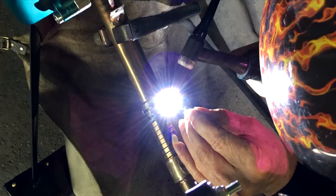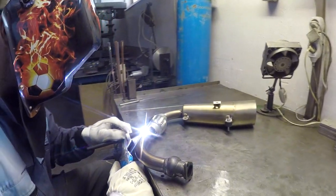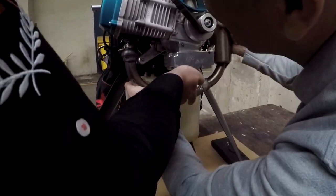Roland from EOS managed to fix the carburation issue. We also had a rough idle at the beginning, so Roland made a few modifications — he decreased the compression ratio, probably sacrificing maybe half a horsepower, and installed a flexible hose into the pipe which helped reduce idle vibration. However, that flexible hose broke twice already in flight, so we had to change it to a higher-quality one. It now has a few hours on it and seems to run really well, but we need to put many more hours on the engine before drawing further conclusions.